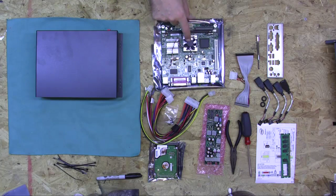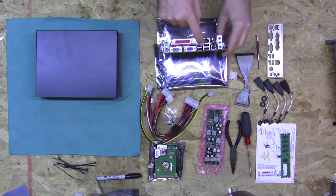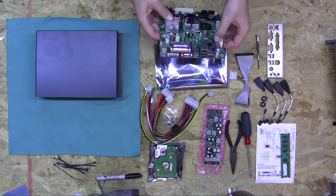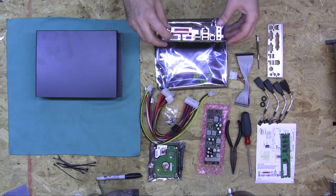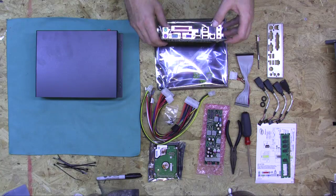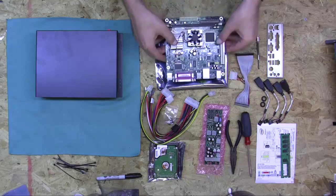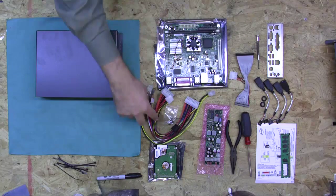We've got a dual core Intel Atom motherboard, which we've been very pleased with the performance on. It has four USB ports on the back, Ethernet, and great quality sound. It has a sound header inside if you need to do any audio there. It has a serial port if you ever want to connect any serial type of telematics equipment or any other type of interface device, and a VGA port. So that's a great set of input-output for a telematics bundle.